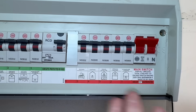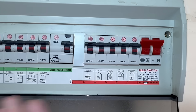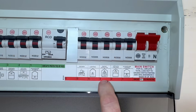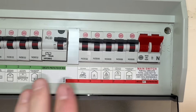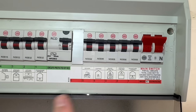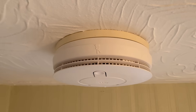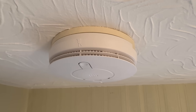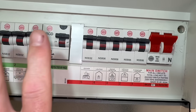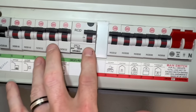Before we remove the cover, I notice the smoke detectors are on their own 6 amp MCB, which was probably a practice in the past. Is that something you still carry on doing, or would you have the smoke detector circuit on one of the lighting circuits? I have inspected the smoke detectors and they are well in date, which gives me another good piece of information when considering leaving this installation in situ.